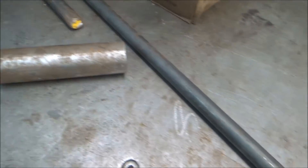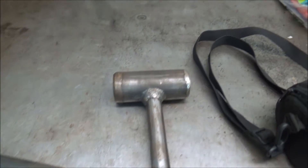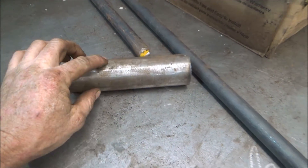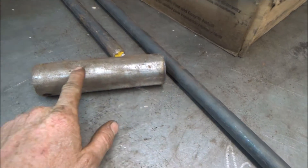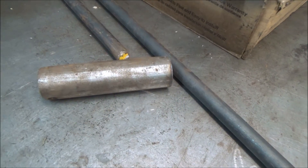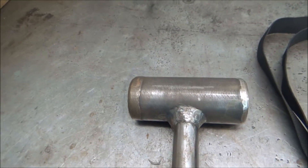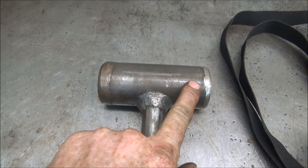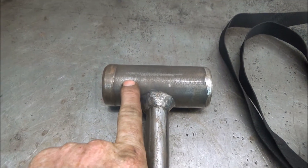So what I'm thinking about doing is making another one. Now that I have a lathe, I'm going to turn all of this down a little bit — both ends — then TIG weld that up and turn it back down to the right size. It will look better than how I did this one. I'm also thinking about making this a little bit shorter because this thing is pretty heavy.